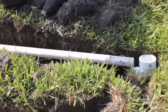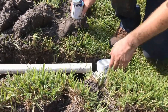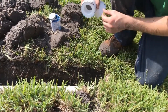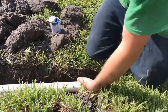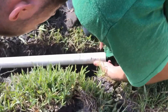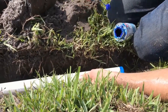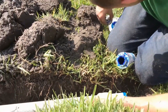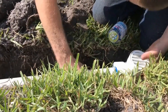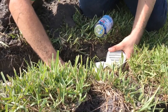We've got one last piece to do. Remember that donut — we've already glued that inside the thin wall. One thing to remember: thin-wall PVC and schedule 40 PVC — even though I'm calling them both PVC — one is polystyrene and the other is PVC. They actually don't weld together; it will make a mechanical bond and it's quite strong. So we put some glue on the end of the pipe and a little inside the fitting, slide it together, give it a twist, try to get it nice and straight. Now we're ready to throw some dirt and backfill.